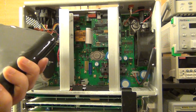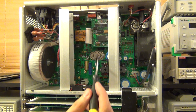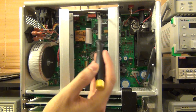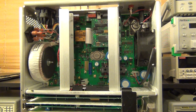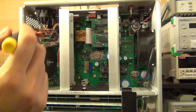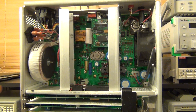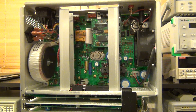So: you tune the varactor, the frequency changes, it goes back up through the divider, into another divider, into the PLL IC, into the charge pump, and back onto the VCO. That's the circle of life of the PLL. I'll leave the exact PLL design for a different video, but I promised to show you the schematic. Pretty much everything we thought we saw on the board is there — it makes sense. Here's the lock detector signal — it comes directly from a lock detector pin on the PLL IC itself, which lights up the LED. Now that we have the schematic, if the synthesizer doesn't work, we can easily come back and poke around in it to find the fault.